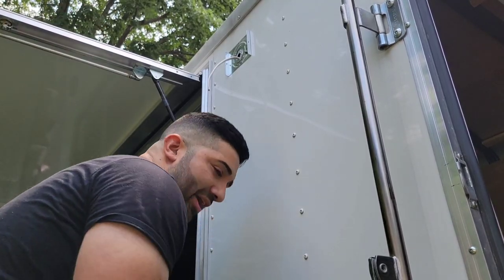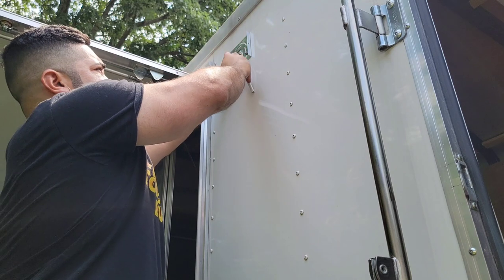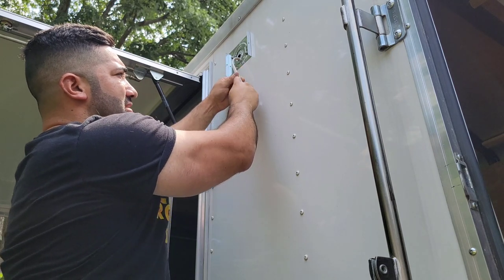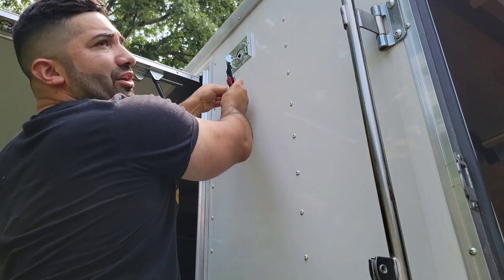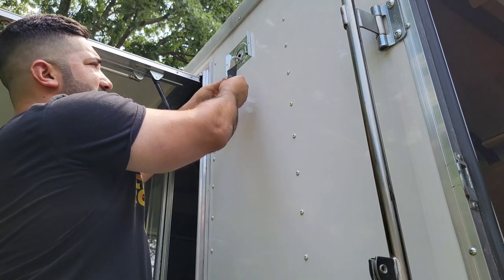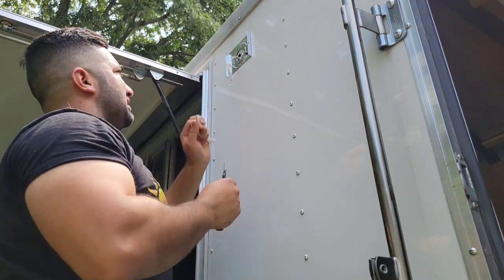And now, since I have the wire up here, I can show you all how to install this light. So what we're gonna do here is we're gonna take our utility knife, we're gonna skin the wire back, like so. Make sure you don't go too hard into the insulation of the wire of the outside, because you can cut the insulation of the wire, and you don't wanna do that because then it'll short out. So you're gonna take a nice, easy skin. You pull this back as such like that. And then you just do that.